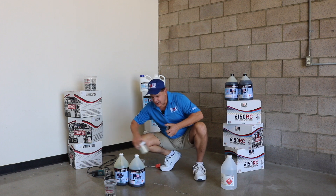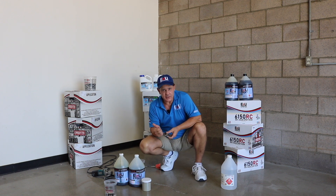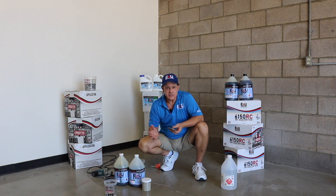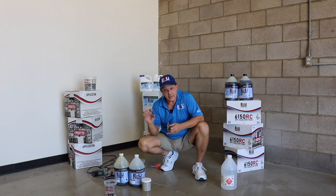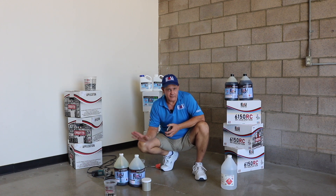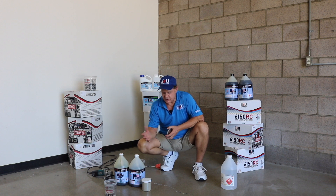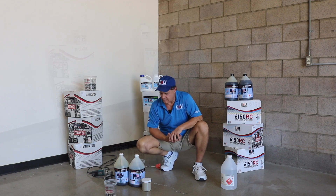The type of sand you add will be dictated by you. You can add 20 grit for a rougher surface; 30 grit is standard. Some guys use 60 grit for a smoother finish, but we also carry a very fine C blend that's almost like for painting — gives you an extremely fine smooth finish, but that's only for rare custom jobs where you want a virtually seamless transition. Most of the time guys are using somewhere between 30 to 60 grit.